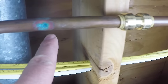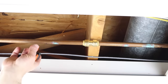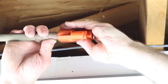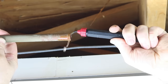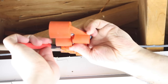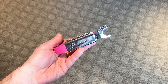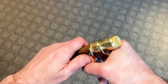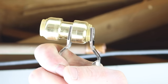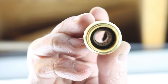The second type of copper pipe fix is to remove a longer section that has corroded. Mark on either side of the corroded section and use the auto cut tool to cut out that damaged piece — it only takes a few seconds. Then deburr the outside edge with the SharkBite deburring tool, deburr the inside, remove those shards using your pipe cleaner, and feel the edge to make sure it's smooth. Mark the depth you need for your SharkBite fitting. SharkBites can be removed via disconnect tongs or C-clips — just depress the release collar on the edge of the fitting and pull it off. Make sure you inspect a SharkBite fitting for any debris inside, because that can interfere with the connection and cause leaks.